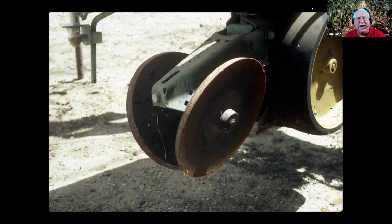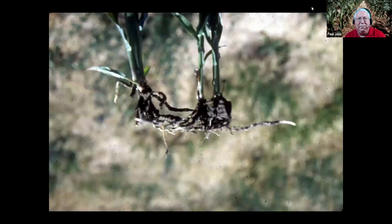Now, what if I use these angle closing wheels and was planting milo 1 inch deep? It's packing below the seed. You're complaining about sidewall compaction. The sidewall compaction was not caused by the openers up front. If you're properly closing the seed V, you'll fracture the sidewall. This is caused by too much pressure on the packing wheels in back, packing below the shallow planted seed. And that's why we plant our milo down 2 inches at least, our beans at 2.5, so we can get good seed to soil contact while we're closing the seed V.